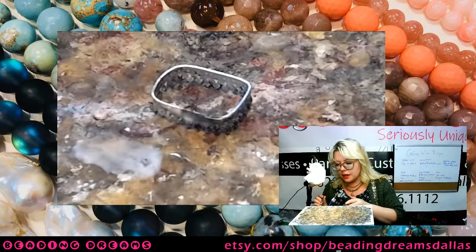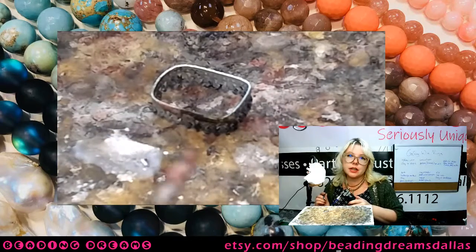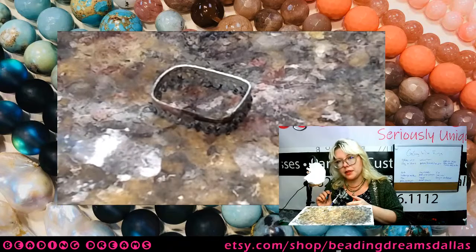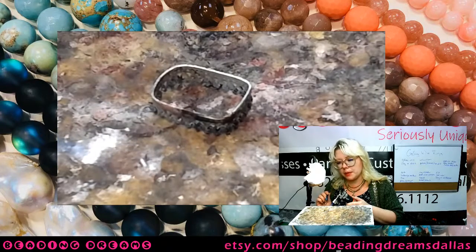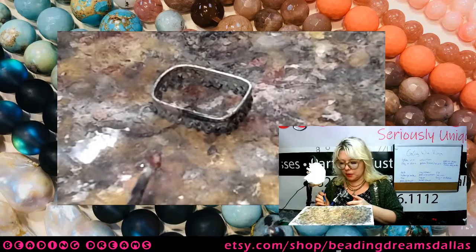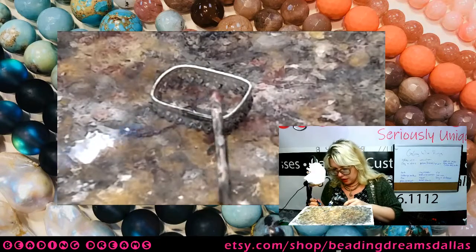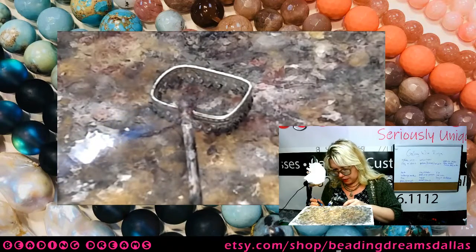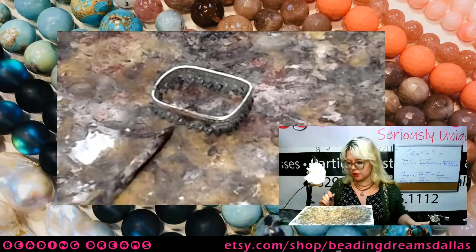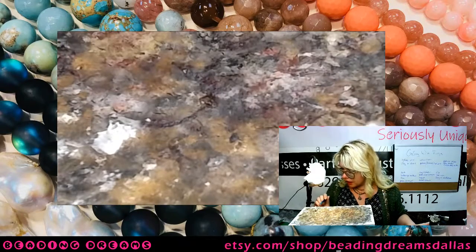Okay, so this did not solder together, so what I'm going to do is pick transfer some solder on there. Pick transfer is usually my preferred method of soldering when I'm not on stream. So I'm going to melt this piece of solder into a little ball. This is still my easy solder. And I'm going to scoop that up on my solder pick, and then heat my metal and drop that off, and I'm pretty sure that time it did actually bond. Yes. I think we're good now.